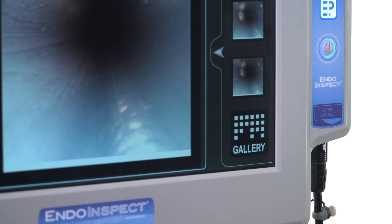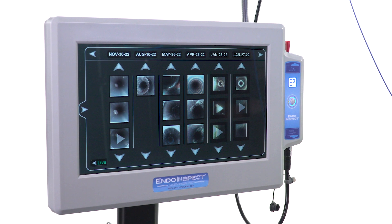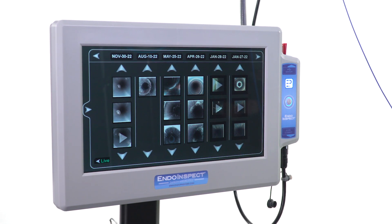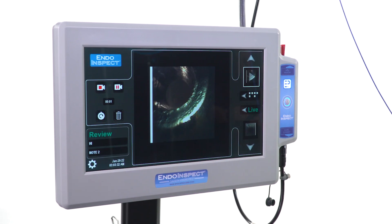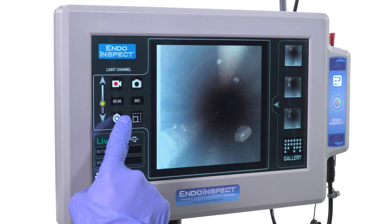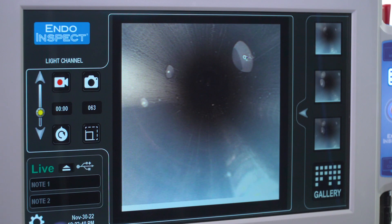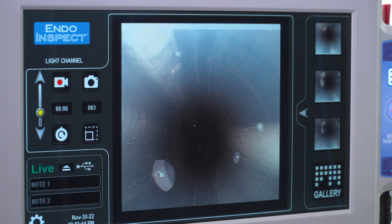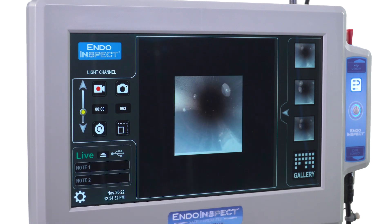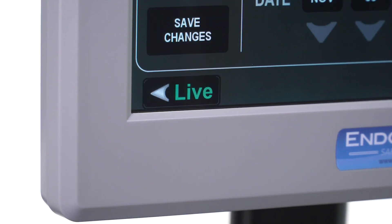Users can return to the main gallery by touching the gallery button. The image and video capture gallery displays the complete capture content stored on the USB drive. The file system is intuitive and organizes saved content in dated folders. Users can touch any folder or file to review. The saved image or video will then display in its own window. Users can return to the live image screen by touching the live button. Users can tap this button to rotate their live image. The image rotates clockwise in 90-degree increments. The white bar indicates the image position normal to the horizon. Tap the zoom button to choose between one-time or two-time digital zoom settings for the live scope image. Tap the eject button prior to removing the USB drive from the system. To access the system status, tap the gear in the bottom left corner.